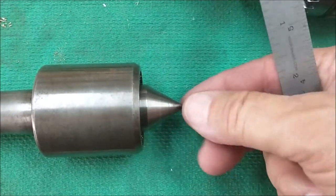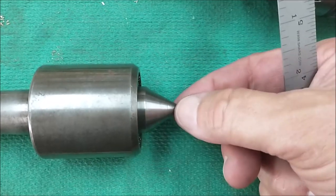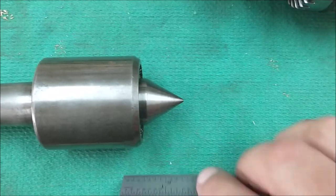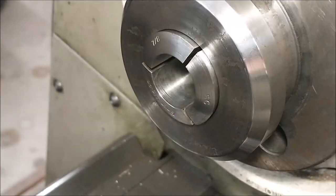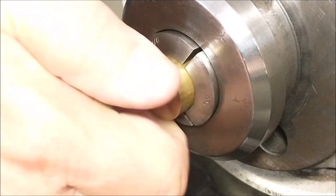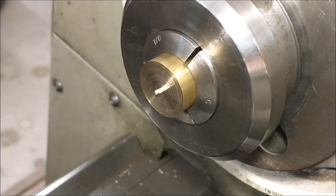I'm going to use a quarter-inch pilot drill so I don't have to bore all the way to a sharp point. If I can bore it down to a quarter-inch diameter, I'm ahead of the game. That will be step number one: load the material, drill the hole, then shoot for the angle. I'm making my center extension out of brass because I have a bunch of this material laying around — it's tough, harder than aluminum in my opinion.